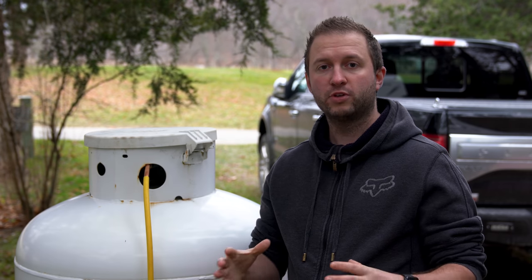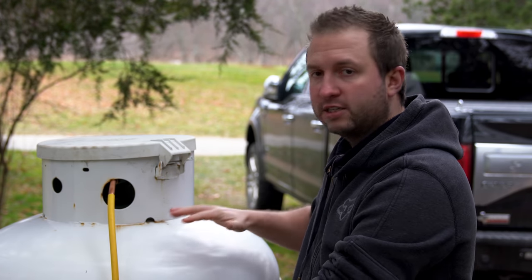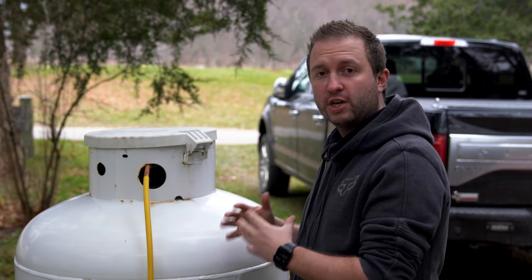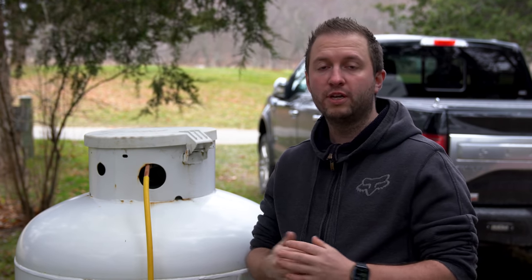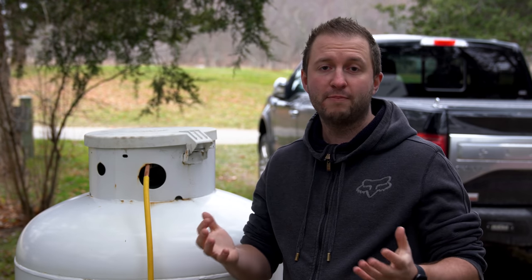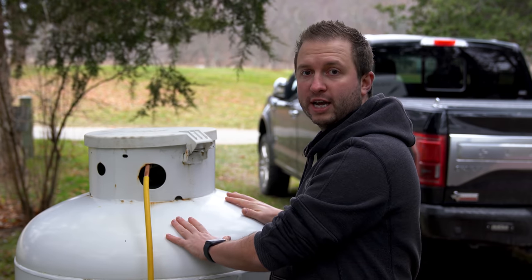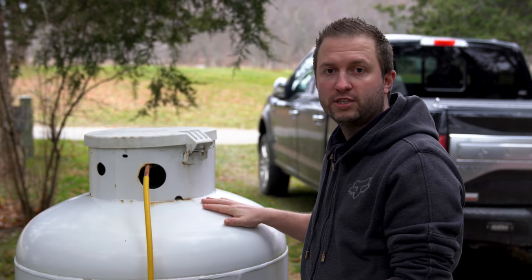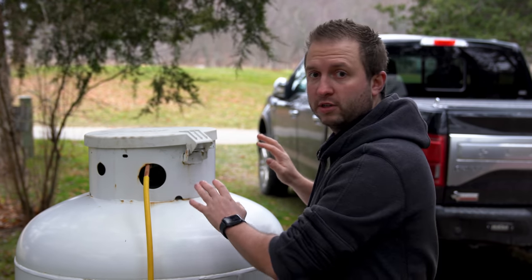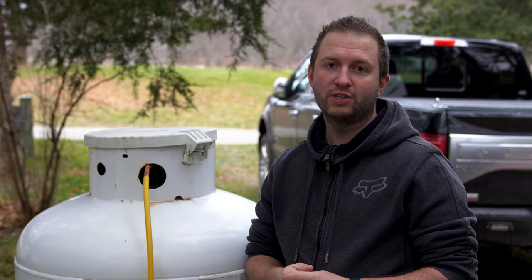More importantly, small tanks really struggle in cold weather. Propane is mostly liquid inside, with pressure forming from evaporation — small tanks have less surface area, so that pressure may not form properly and appliances can shut off even when there's liquid propane remaining. With a big 100-gallon tank we have no concerns. The delivery company will check in every few weeks, and we still have the original 30-pound tanks that are nearly full as a backup if needed.